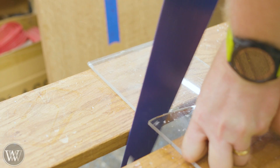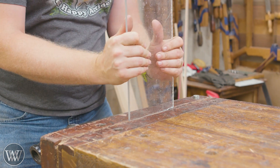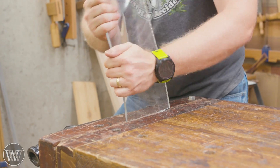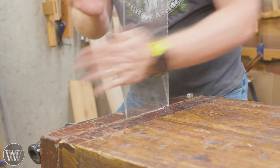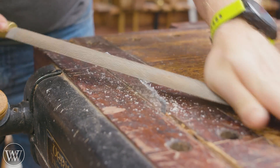Normally I would do something like quarter inch wood or quarter inch plywood, but I want a nice sharp edge and plexiglass works really well for that. The problem is the quarter inch is a pain to work with — it shatters easily and it's hard to cut. I thought I'd snap it like I would with thinner ones; you can just score both sides and snap it. But this one takes a lot more force and never quite gave me a really clean edge.